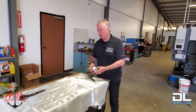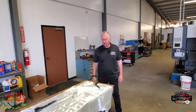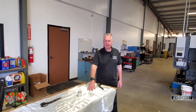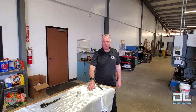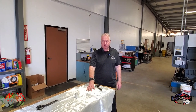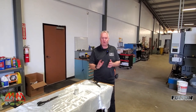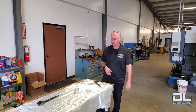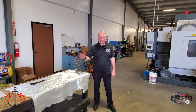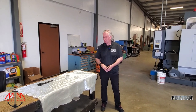We're also going to bring out the cutting table and have everything laid out. If you use this 1708 stuff, I would treat it very gently. We've kind of abused this sheet and I think it shows because it gets twisted. If you get a sheet in, I'd strongly urge you to take good care of it. And if you can get it in a roll, it's better — this came all folded up and that's not the best way. It's the cheapest way to ship it, but not the best when you're trying to cut certain sections. Get yourself a good pair of shears.